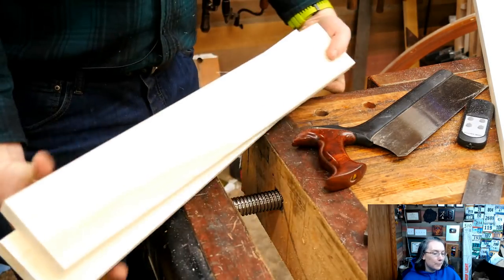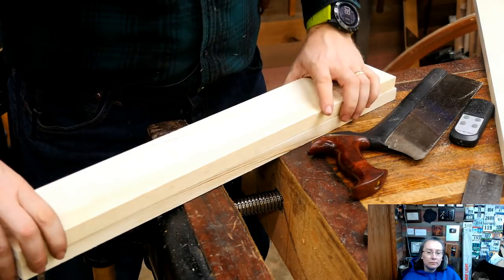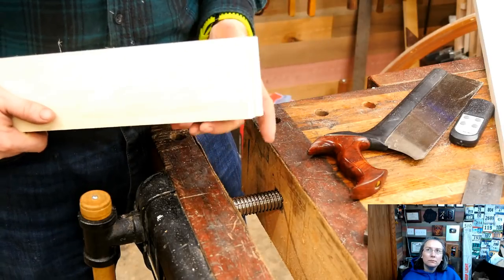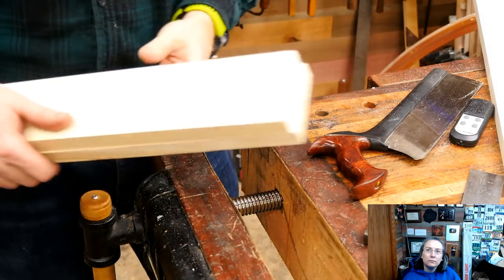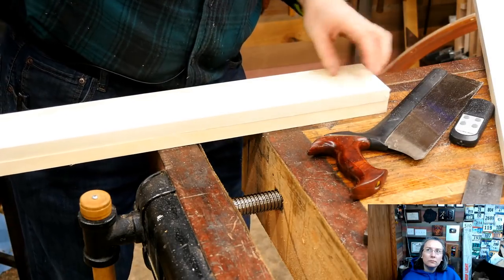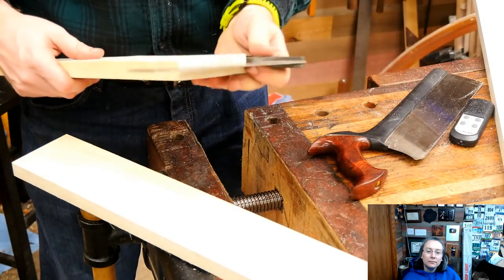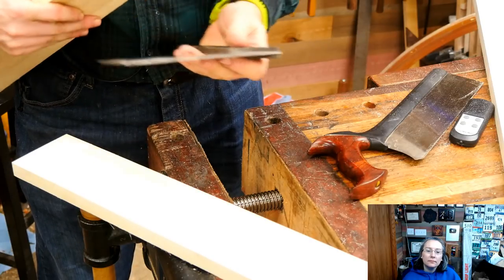I've developed the cut all the way across the board, dropped the heel farther, watching the line on my side, until they connect from one side to the other. I've got a really nice clean edge all the way across — perfectly square this way, perfectly square this way. No cleanup needed because I watched and stayed on the line all the way around. I measured this one to be two foot long, but my board was slightly longer than four foot, so I've got a little difference. I can draw a line and cut this again, or use a plane and plane it down to thickness.